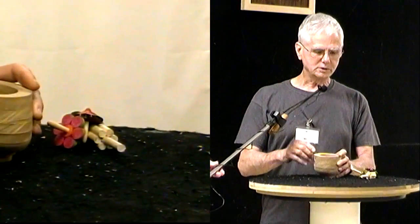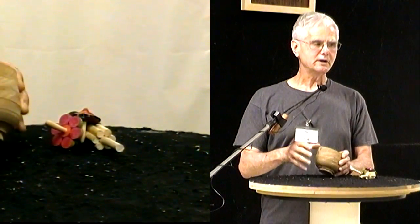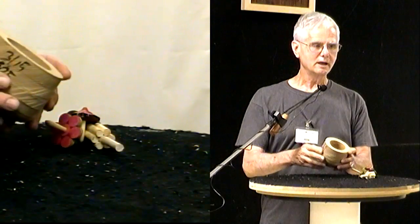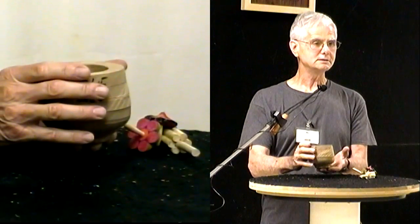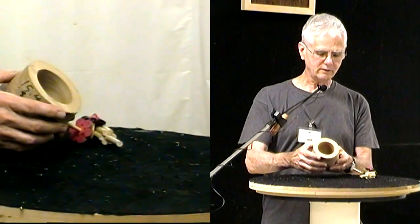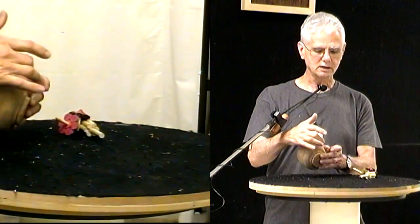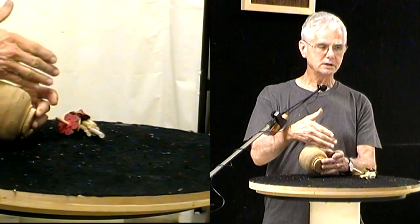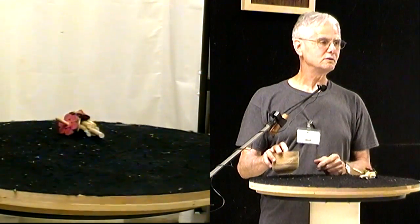I went to the Urban Lumber Company and bought some green wood, and I had a couple of them turn out, but this one I turned green and let it sit around, and I dutifully waited after a month or two. And then after about 6 months, I don't know whether you can see it, it kind of looks like the Leaning Tower of Pisa. And it's actually kind of a study in what not to do. If you look at the way the grain pattern goes, you would think that it would do this. So as you turn it green, the grain pattern either needs to go this way or this way, but not diagonally. So I thought that was kind of interesting, and it doesn't hurt to show a few fails.